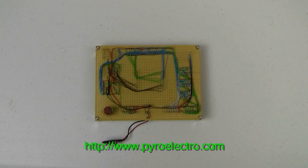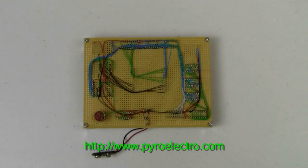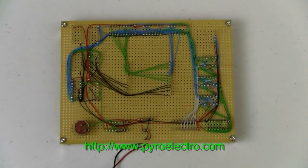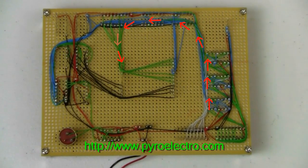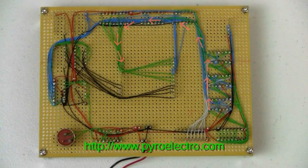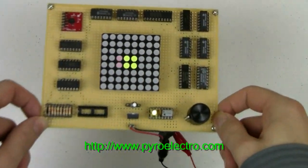The last part of the project combines the eight-state machine circuitry and the newly converted accelerometer data. The 12 unique outputs from the comparators are input into the LED drivers, telling the system when and where LEDs on the matrix should be lit up, which then completes the system design.